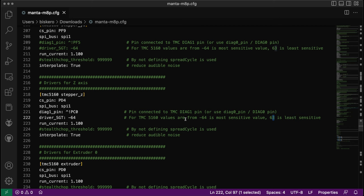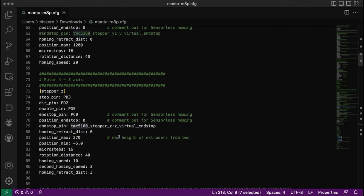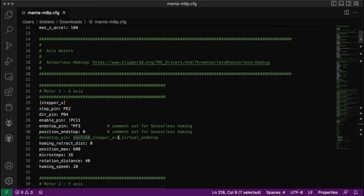Now, you need to figure out this value for your particular driver, and it's not the same even for the same driver. For example, you might end up having the same 5160 driver on two axes, but this value will be different. So you need to figure out which value to set. How do you do that? There is a good guide on the Klipper site, and let me go back all the way up where I set the link. I'm going to put the link in the description, but if you go to the klipper3d.org site, you will find the sensorless homing guide.